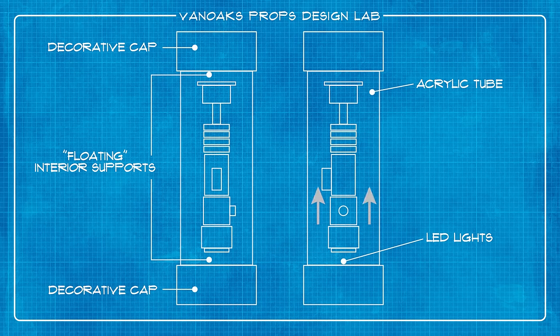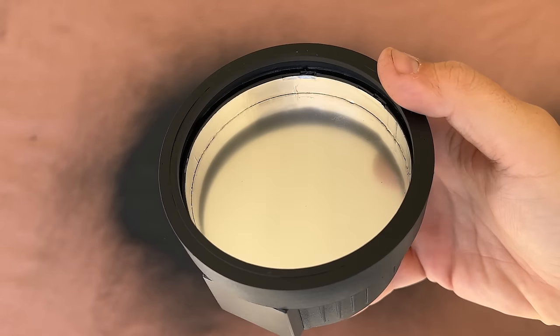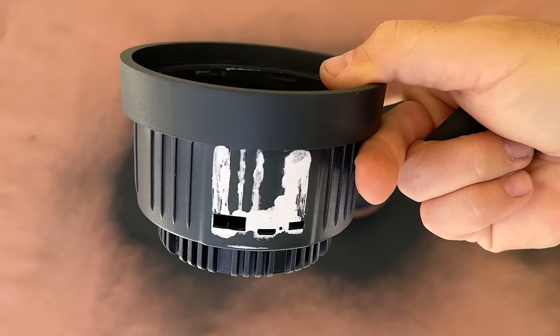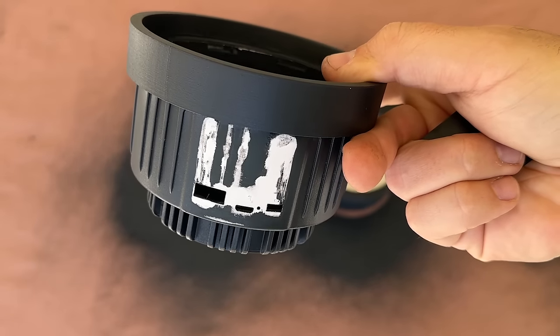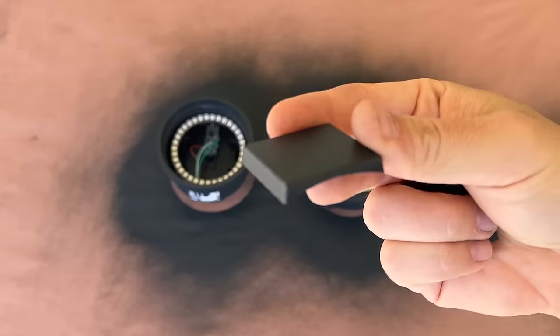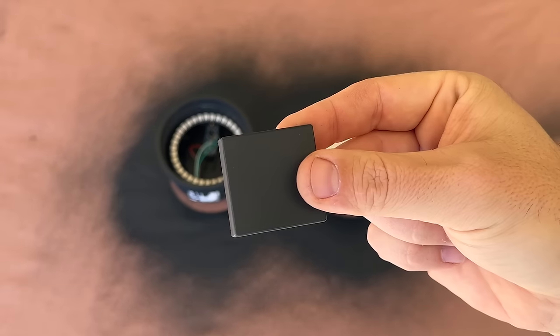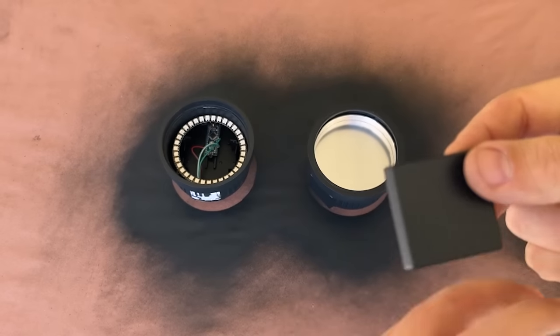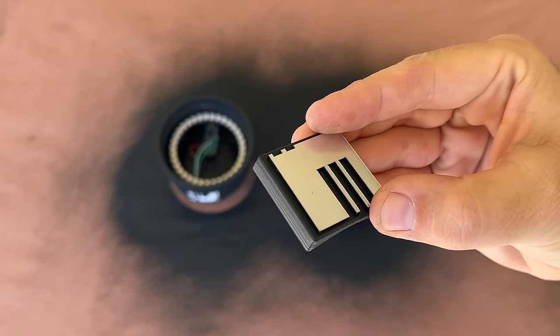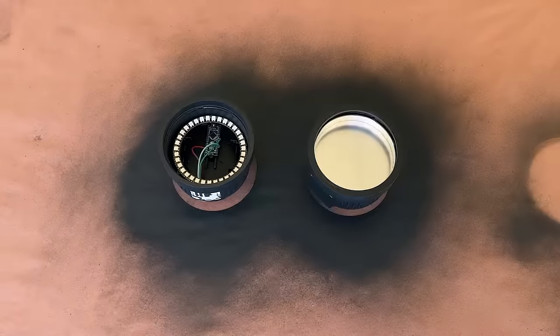Because the light source will be below the saber, I thought it was important to add a reflective surface inside of the top cap to help bounce the light back downward, so off-camera I added a small disc covered in aluminum tape and glued it in place. The next thing I needed to deal with were all of the lamp switch holes along the edge of the caps. I had originally intended to use some acrylic to cover them up, but found that the bend was a bit too severe and needed to pivot to a different approach. So I hopped back into Fusion 360 and 3D modeled and printed small covers, which will then get an acrylic applique glued to them.